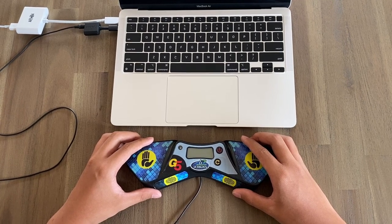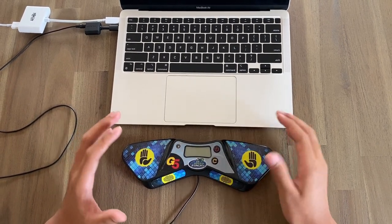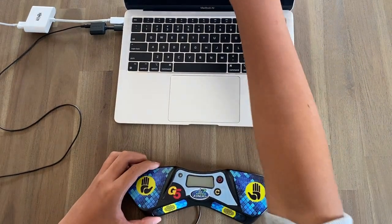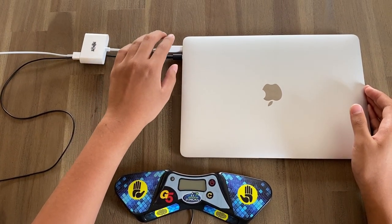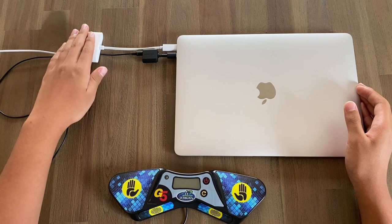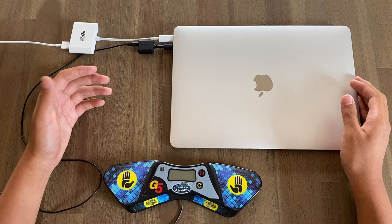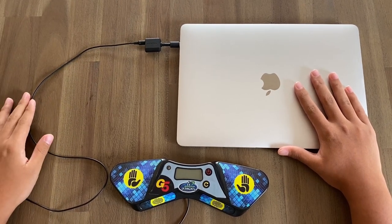Finally, I'll go over a couple of troubleshooting tips. The first thing you might run into is that your timer is suddenly stopping at 0.007 or 0.008 seconds, or something of that sort. One of the things that can cause this is electrical interference. As you may see here, I have two things plugged into my computer — my timer and this USB-C adapter, the dongle. The electricity flowing through my dongle might be interfering with my wire. So if this is happening and you have multiple devices plugged in or some electronics next to your device, I recommend unplugging everything except your timer from your computer. This should fix most of your issues.